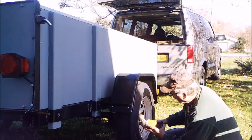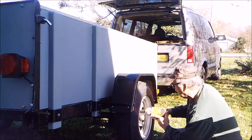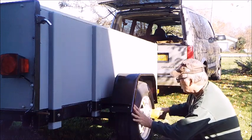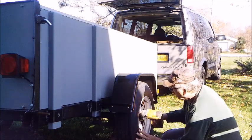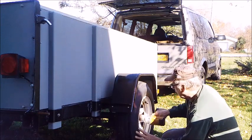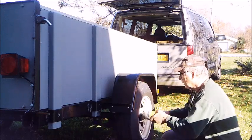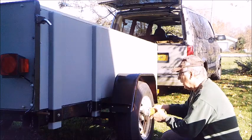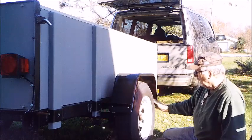Now when I do a wheel, take the first nut in and you'll see it center the wheel on the taper. Then you go to the one opposite. When that taper hits the chamfer on the wheel, it will center it all. I gotta be careful with this one, because it'll strip them out. That's tight enough. All right.